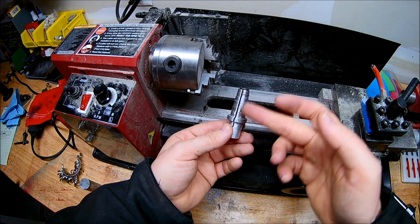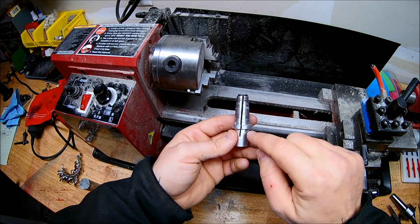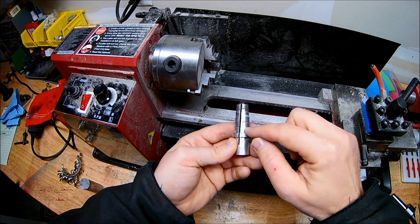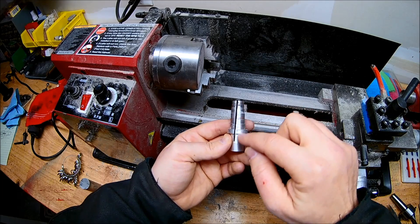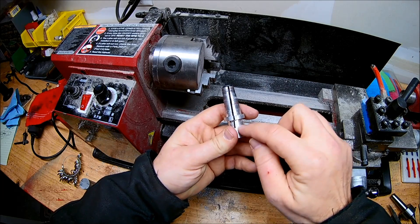Now you're going to have to do some cuts in it, and you can see where the bandsaw started to walk a little bit. You want to make sure the cuts are past where you want to expand, because the expansion point is going to be here instead of up here. So if I wanted to do the size 8, I want it to expand down here so that it pulls out and holds this area, rather than where its fulcrum or bending point will be.